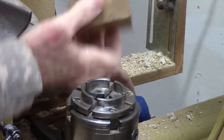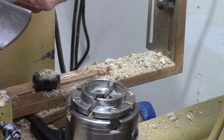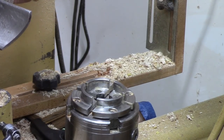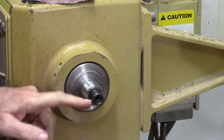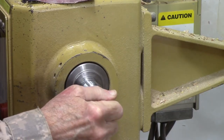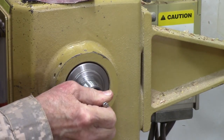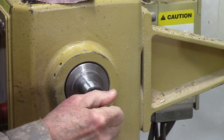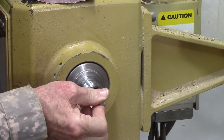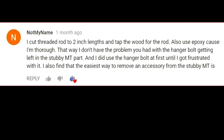For the other end, I'm going to make a soft touch — that's hollow — to fit onto my Nova Live Center. I've drilled a hole and put a little scrap of wood into this short stubby Morse taper and I'm going to thread it on here. This feature uses a 5/16 inch threaded rod. I cut a short length based on a tip from one of you viewers who said instead of using bolts, use a piece of coarse rod — it's cheaper.